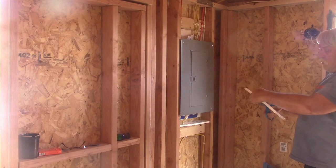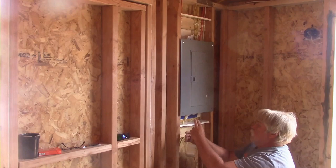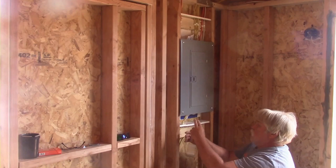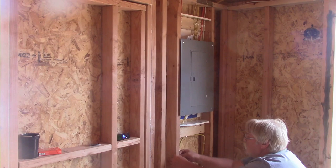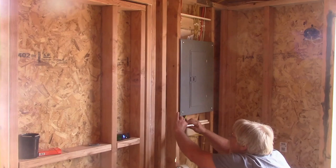Now, it worked out well. I used sealing tape and wedged some 2x4s down into the bottom recess to attempt to keep the expanding foam from leaking into the electrical panel. I like my electrician, and I want him to continue to like me. So, by keeping the foam out of the panel, I think we'll have a good, long friendship.